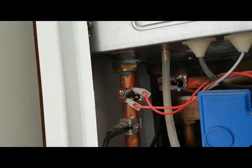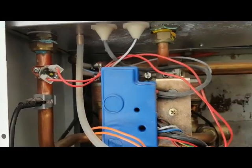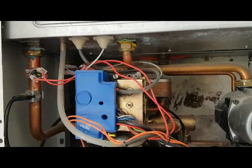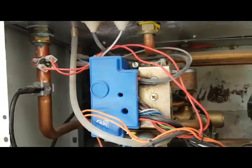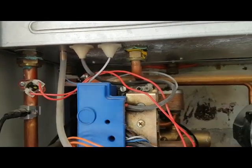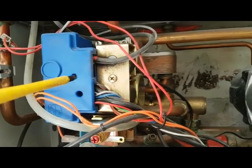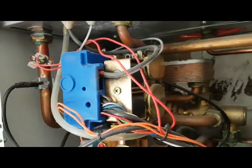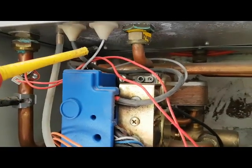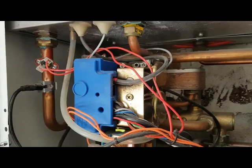At the same time you've got this sensor here on the main flow pipe — the overheat thermostat — and once that takes place the fan runs. The air pressure switch is made, which sends the signal down to the ignition control box — the blue one — which then sends a spark up this lead. Once the spark takes place, the gas valve is opened, energized by the ignition control box. The gas is released, the spark lights the gas, and the burner is burning. You've also got the flame detection lead on the end of the probe that monitors the flame and keeps the ignition going. Then you've got your hot water.